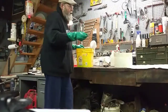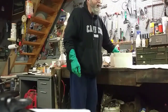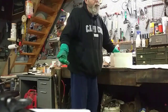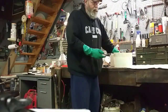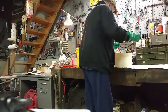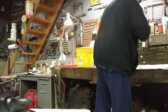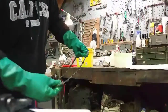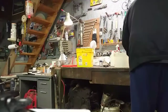After brushing, I have a second tub — just water. When I first fill it the sink has hot water, so I use hot water; that seems to rinse it a little bit better. Cold water works fine too — I don't change the water until it gets really dirty. But if you're only sharpening a couple of chains and not doing it for a while, use hot water for a better rinse. When I'm done I simply put it on a towel, wrap it up, and it dries right up. You can see even the sides look cleaner — that grime is gone — and that's ready for sharpening.